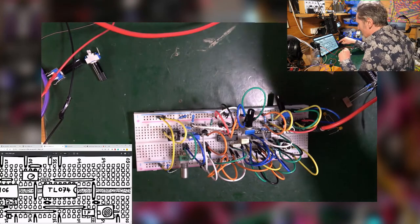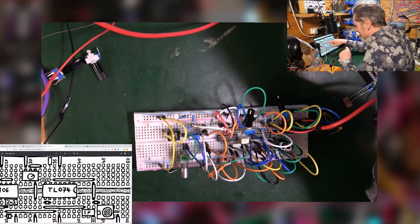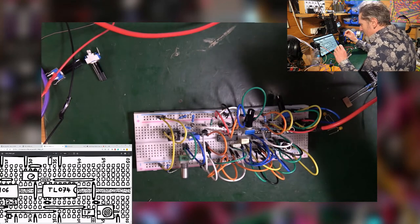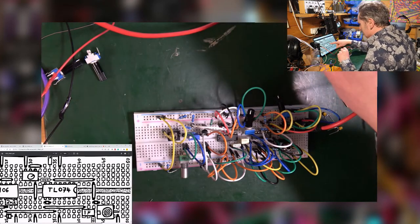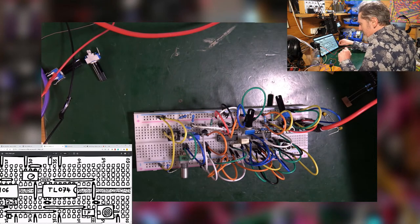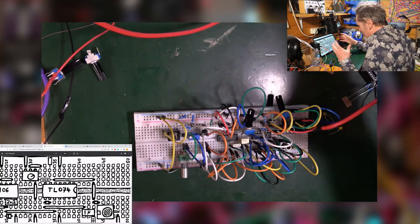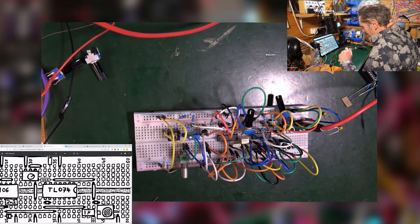So anyway, coming back to this morning, I went back through the breadboard, back through all the bits, looked at the diagram for the op amp, and realized that this output here was not connected. So I thought, well, surely if I'm going to connect it, all it needs to do is go to the output. So I connected it over to the patch socket over on the far right by plugging it in next to where that really small patch wire is. And it worked. I took the left-hand wire from that little one and plugged that into pin 7, and there it was, working. Brilliant. There's an output. Yes, it was louder than a sawtooth, but not terribly loud.